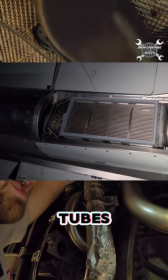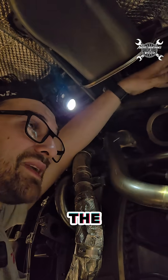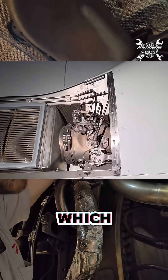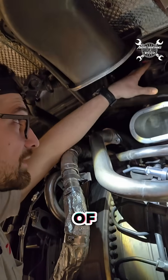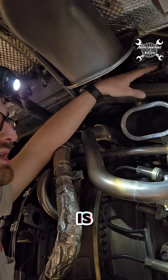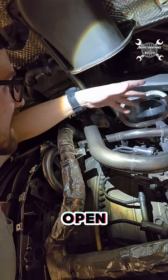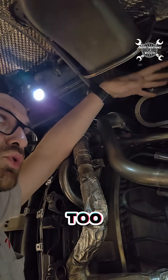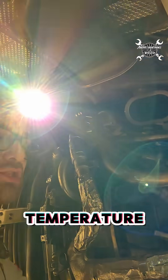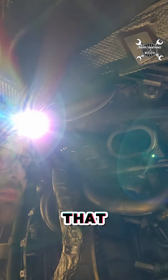This duct leads exactly around those tubes, and the air passing through it cools the bleed air. Behind the pre-cooler you have a thermostat which controls the temperature of that bleed air. If it is above 200 degrees, the fan air valve opens to cool down the air. If it is too cold, it will close the fan air valve, giving us the exact target temperature of 200 degrees. It's that simple.